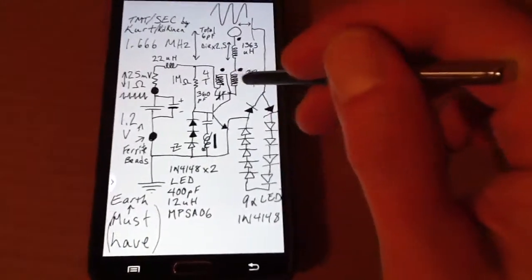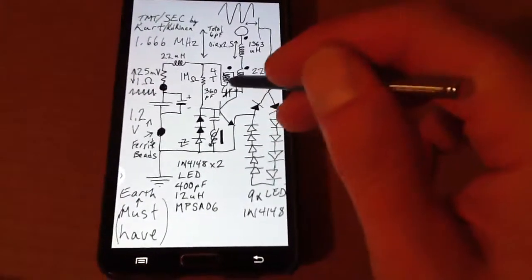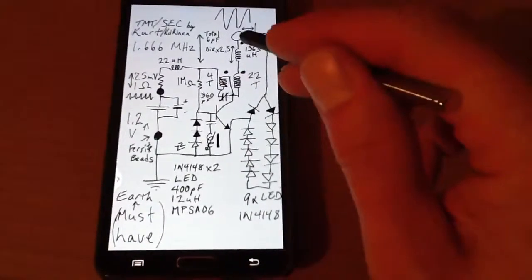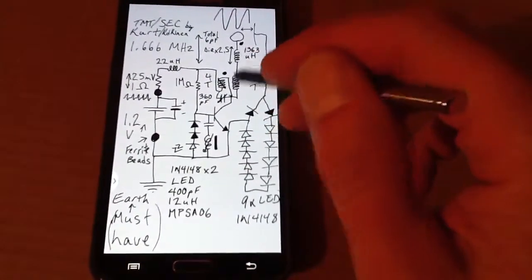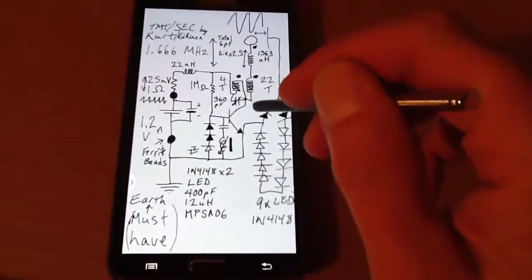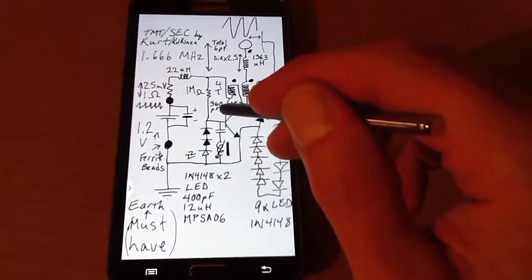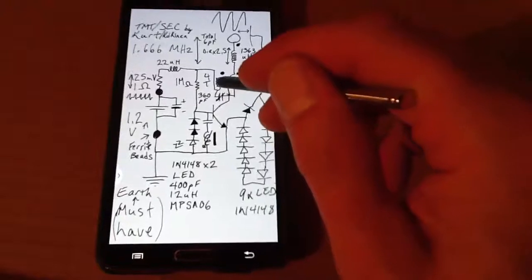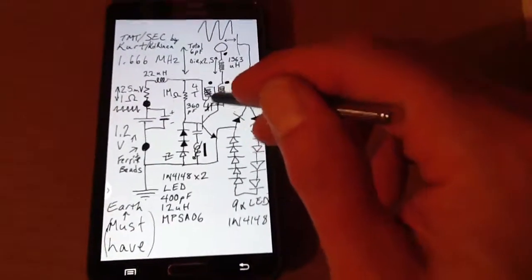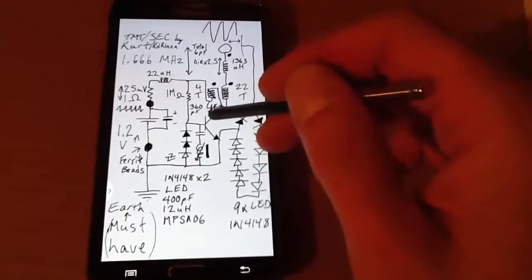Top of the coil had to hook to the bottom because I think they have to be kind of out of phase or whatever. They're all wound the same direction, however. So the taps I can adjust on the primary. I can also adjust the capacitance up to 360 picos. It's not quite at the limit. When you tune it, you want to set that in the middle so that you're not maxed out and you have the ability to adjust.